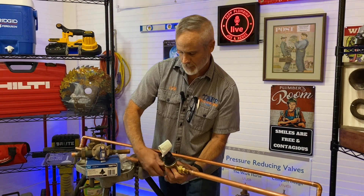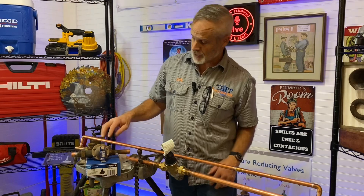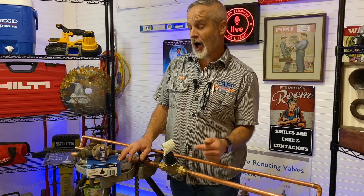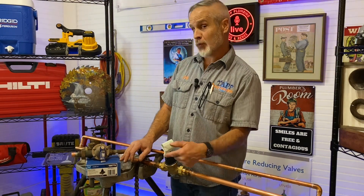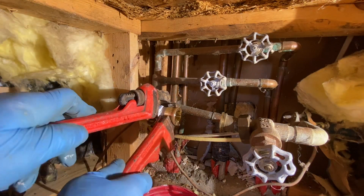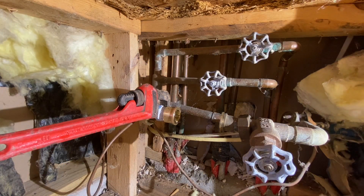That's how it works — these valve bodies are so much shorter than the ones that only have a union on one side. This also works for the Watts 25 AUBs and the Watts that also has double unions, the smaller body valve. However, these Watts regulators with two unions and smaller body valves are pretty notorious for making some odd noises right out of the box, so be aware of that if you choose to try this method. This is also the perfect time to mention that these union nuts are definitely brand specific — what we cut out was a Wilkins Model 70.